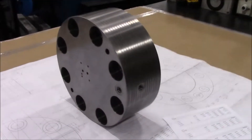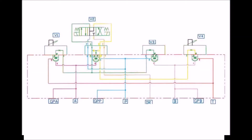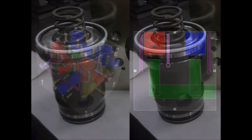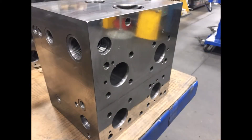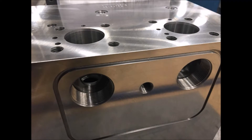The cap can be customized to optimize pilot flows to offer endless functions and hydraulic control over the valve operation. Logic valves are high flow poppet or spool elements that are controlled by small pilot devices. The average cost of logic valve elements can easily exceed the cost of a manifold in a hydraulic system.